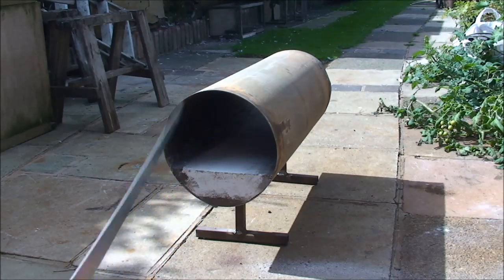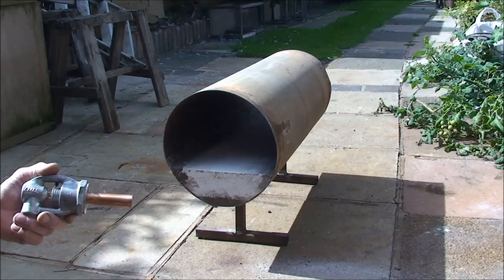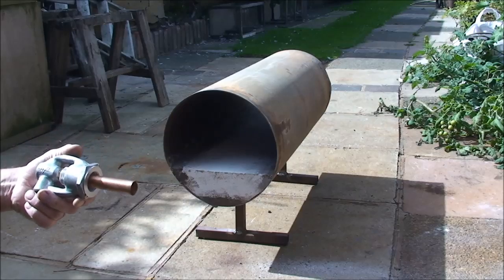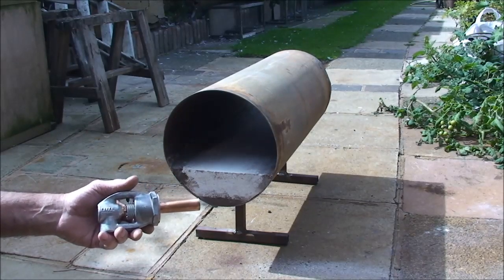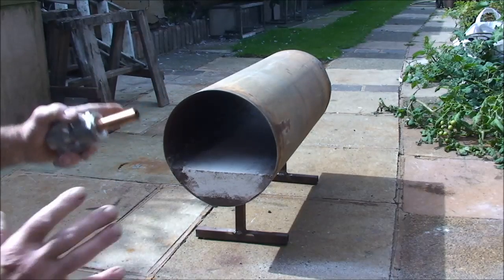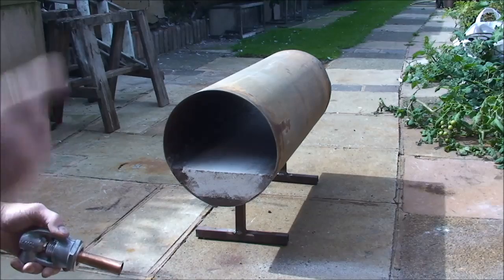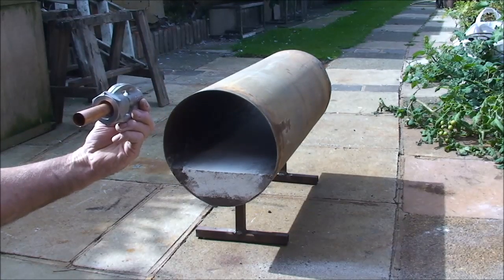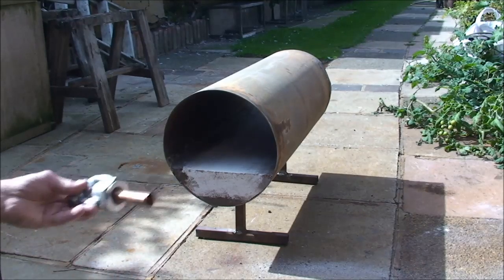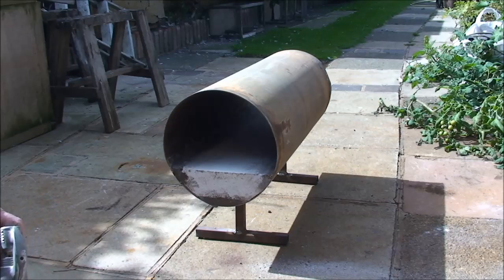It may seem silly making this just for one sword, but I intend to do more swords. I'm also going to make another forge and see how this design works — I think this oven will get hot enough to forge weld, but I'd need one slightly smaller, maybe half the size with a bit more length than my current forge. The burner won't be fixed in any way; it'll just be held in position at the back so it can be used for other things. This was just making use of an old gas bottle that was going to go to scrap — and it'll be a good test for a new forge design.